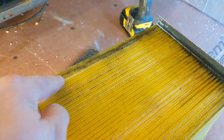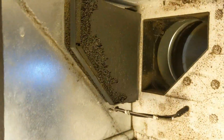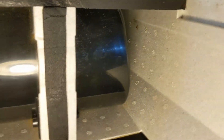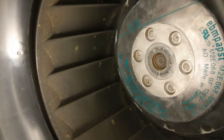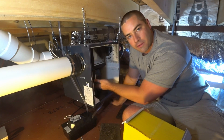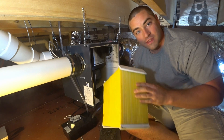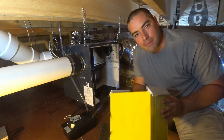You can see that even though it looks a little dirty around the edges, it's actually clean — we can see through all the holes so it's not clogged up. You can better see where that intake port comes in right there. And there's a temperature sensor. There's the blowers — one motor and two fans. When we look at this it's fairly simple: you have some sensors, a fan, and this heat recovery core. This recaptures 85% of the energy and makes sure that we keep having fresh air in the house, so it is absolutely worth it.